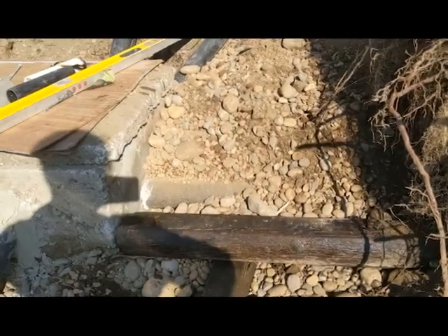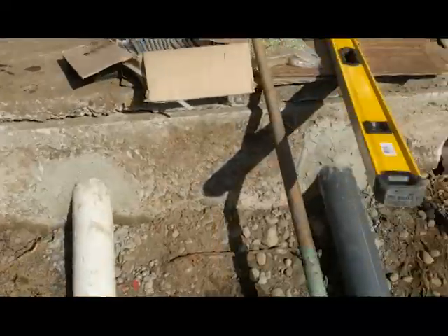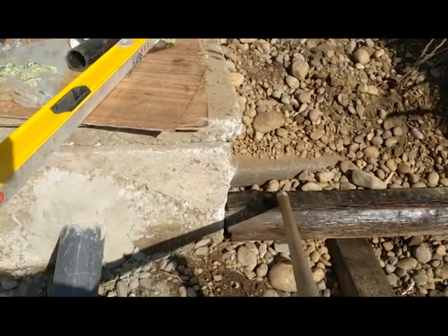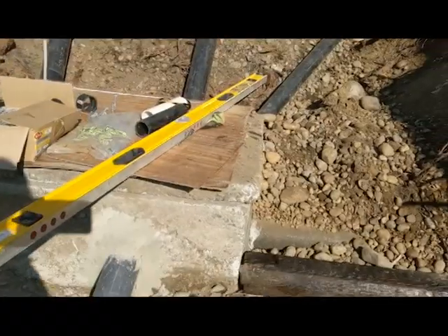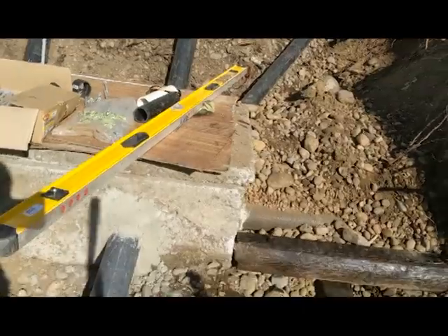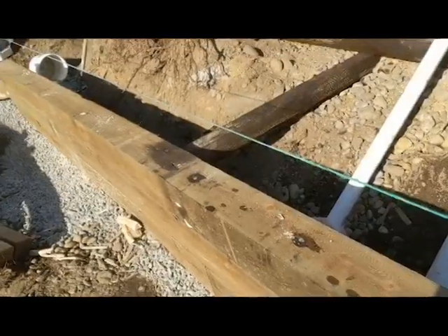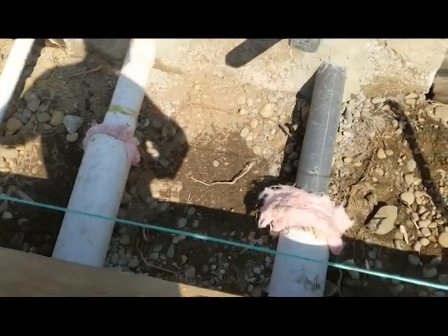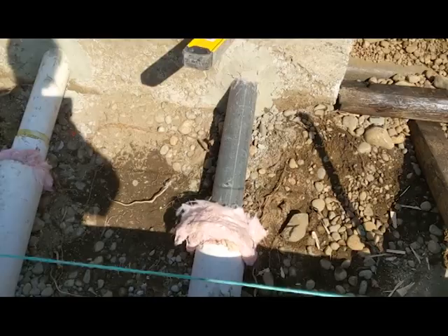Here on my retaining wall, put some braces in there to hold it in place. A four-foot rebar, like you guys can see — this rebar is going down on both sides, that would hold the weight of the soil and hold it down. Just make a cut that way once you look from the outside, you don't see the wood passing through — all the wall would be clean. Somebody might look at it and say the wall is not braced, but it is braced.